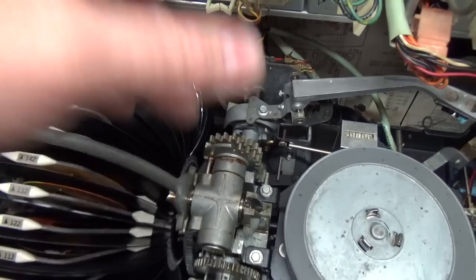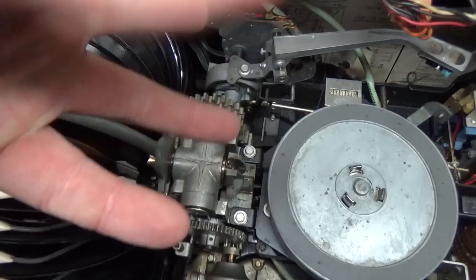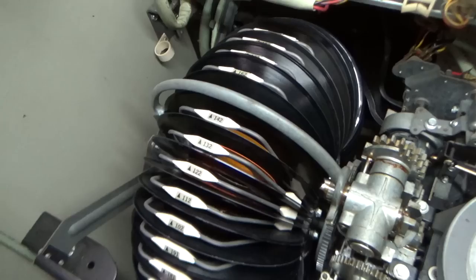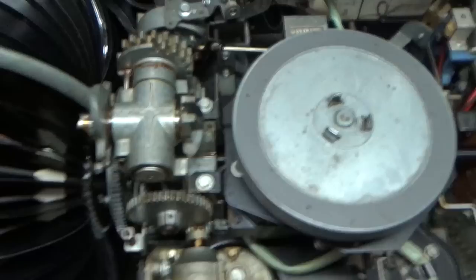So since it's turning, the gears are turning, and it's making all of this do this incredible little work that it does, where basically this bar starts pulling in. And so that's what's happened here. It has pulled in and grabbed the record. It's actually pinching it. Look at that. And because that bow has moved, it's now touching it on both sides of the record. And this thing is made a certain way so that it can perfectly pick up a 45 7-inch record.